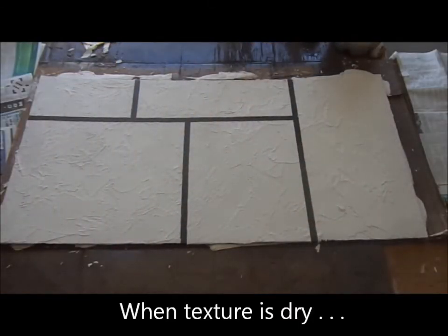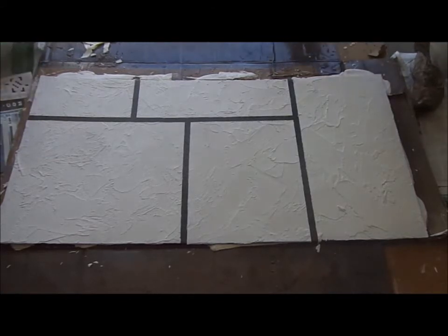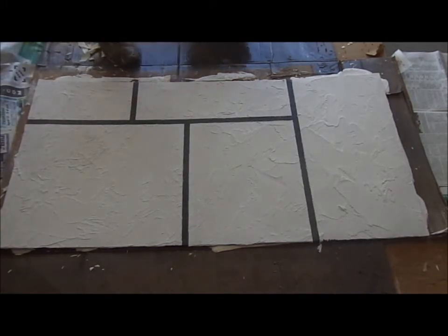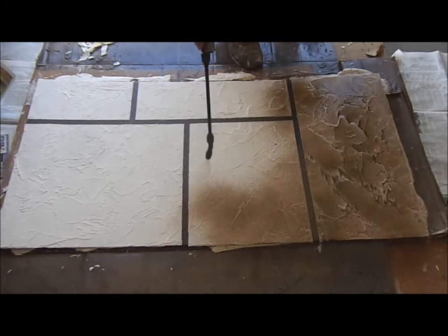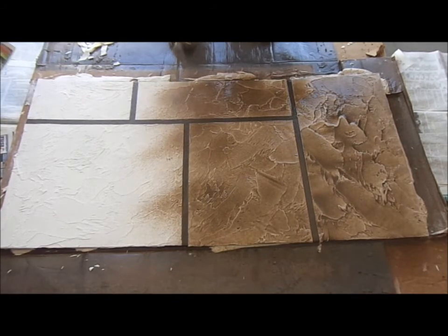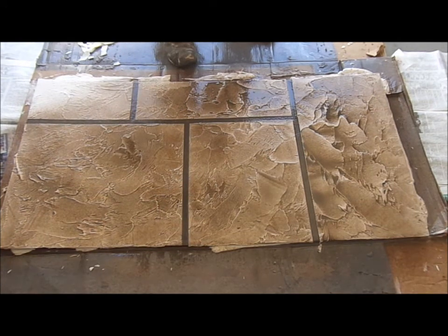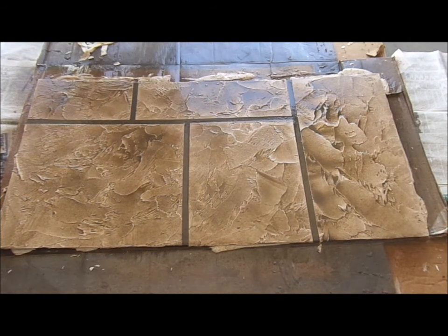I've got some color fusion stain — it's kind of a homemade version of it. I think I've got 25% espresso, 50% sand dune, and I did add 25% snow white. What I'm trying to do is just tone down the espresso a little bit, because that's extremely dark. I'm gonna spray it to just slight puddling. So even though I've got lots of sand dune and some white in there to tone it down, the majority of what you're seeing is a brown color from the espresso.